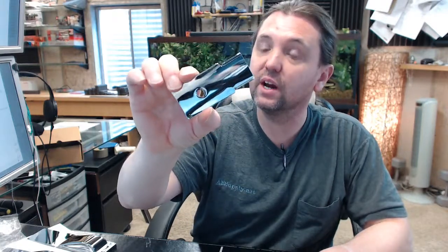If you can't do that, you're going to have to adjust. And we'll get to that later, but well, the truth of the matter is the adjustment that's required is there is what I call a heel plate, which is not directly referred to on the installation instructions, but this heel plate, which is going to dress off the end of the installation, forgive me, is based on that radius. So if you don't have a radius on the edge of the door, your heel plate's not going to fit very nicely. So you'll want to give consideration to that radius.